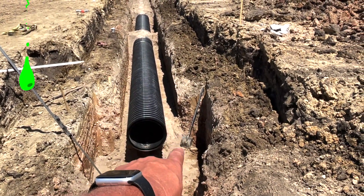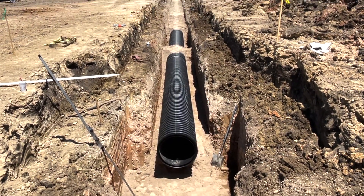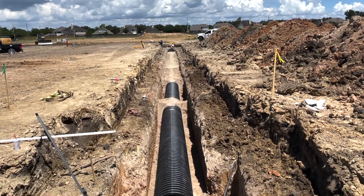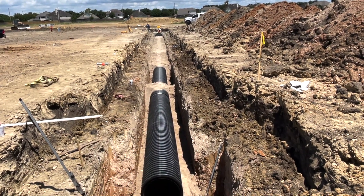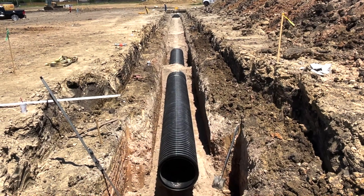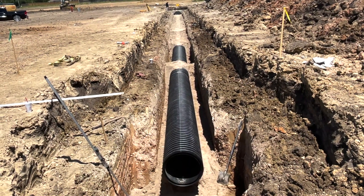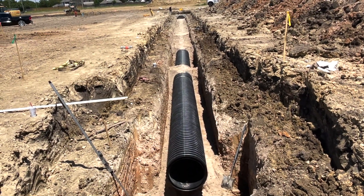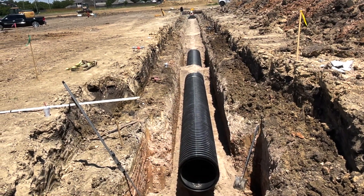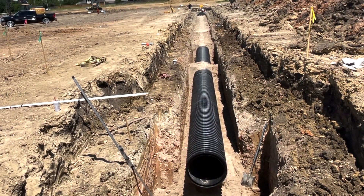We'll look right up under there. You had to put a bed of stabilizer sand, you had to go down through there. You had to have a minimum of six inches, and you had to go down. Then you had to cap it — you can't cap it until your inspector sees it. So this is how the storm gets set. The stabilizer sand has the cement mix in it. When that stuff gets hard, it'll keep that pipe from bending and stuff. It'll start collecting water and all that, it'll get stop-ups. It keeps it nice and straight.